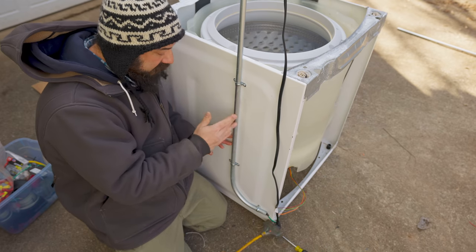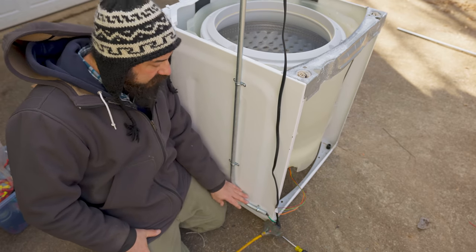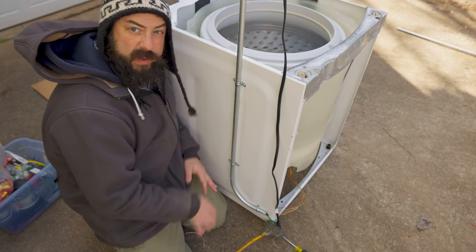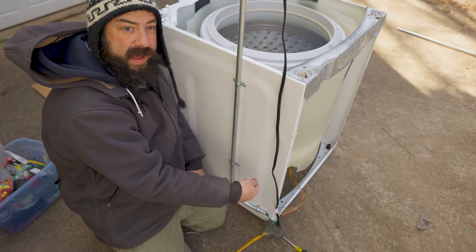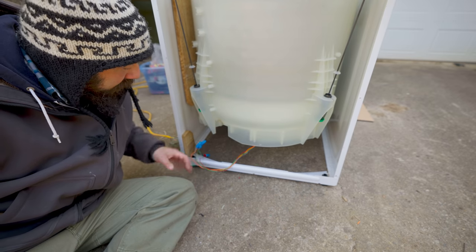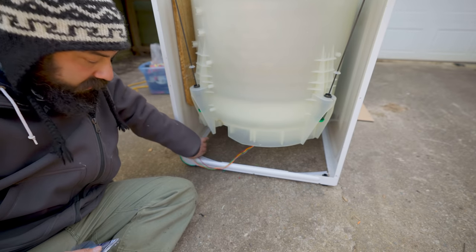Here's the half-inch electrical conduit coming down the side. I used a half-inch pipe bender and bent a 90-degree on here — totally unnecessary, but I like it because it shoots the wire out backwards toward the back of the washing machine and keeps it from twisting. The wires come out and go underneath in the back, where I made the connections. I made all the connections here based on that wiring diagram, and I'll attach all the wires out of the way.